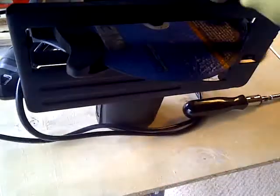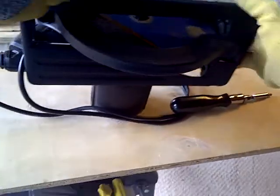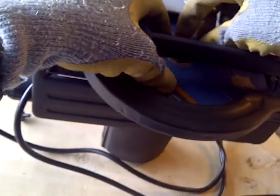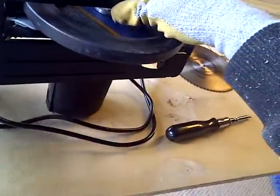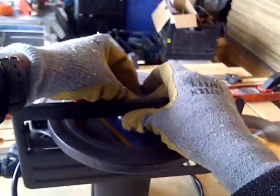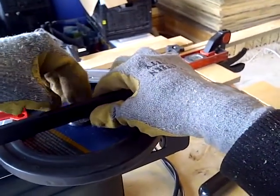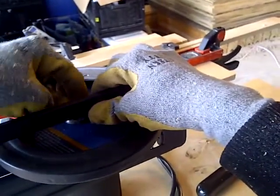So in place of that, let's put this in. And this is a 7-inch 5/8 arbor. Look at that, the 5/8 arbor just fits in really nice. Now it's a metal cutting saw, so you don't have to buy a metal cutting circular saw to do this. By all means, if you want to, go ahead, spend another $50, $60. I know they're not that expensive for an extra metal cutting saw, especially if you know where I got this. But the point is, now you can use what you have right now to do the same job. So it shouldn't really matter.